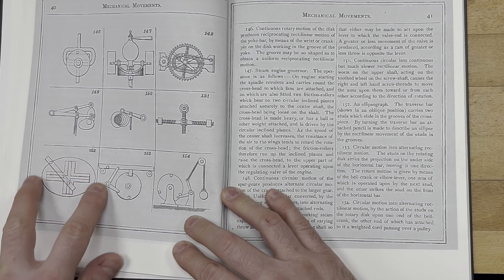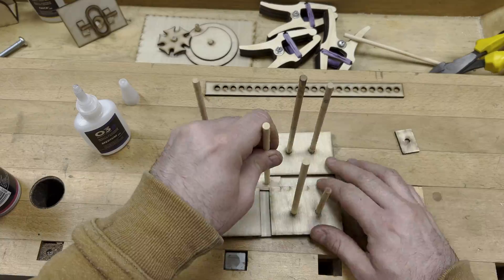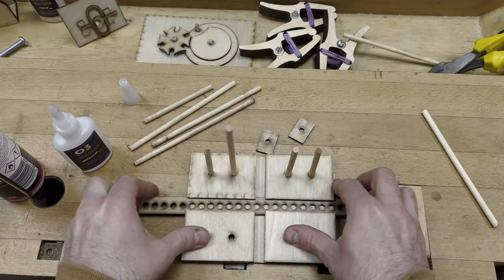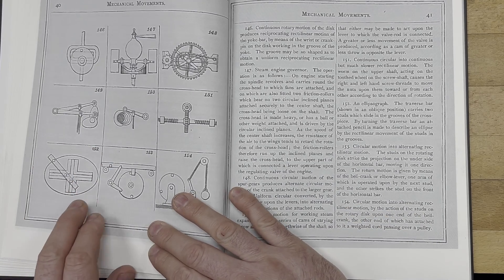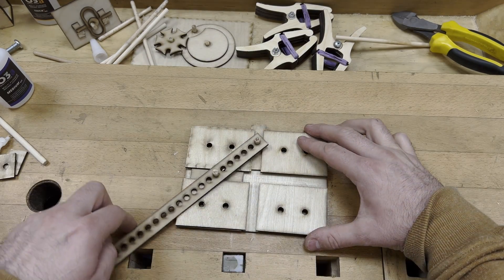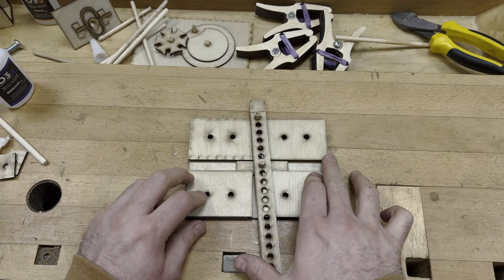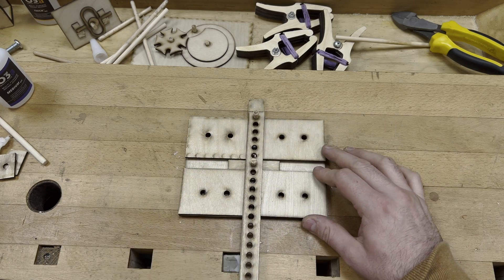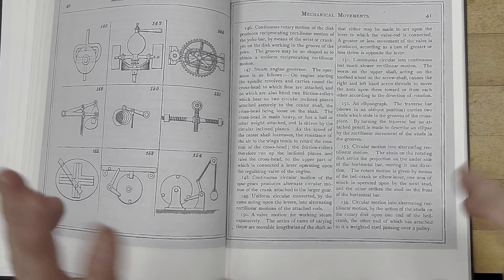Number 152 is another one I've taken on. These sorts of mechanisms are what I'd really want to encourage woodworkers to try. If you're using a woodworking router, I feel passionate that you should be applying some of this — learning mechanical skills helps you create things that are different and more adventurous. With this mechanism you can create ovals fairly easily by attaching a router to the end of it. It's adjustable — you can move it on the pin to make different sized ovals, whether you want an oval table top, a table foot, a mirror, or many other applications.